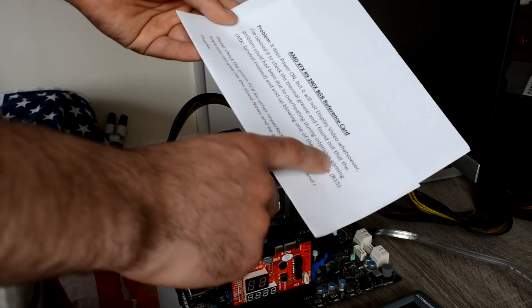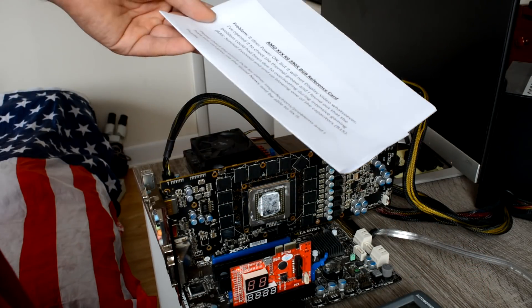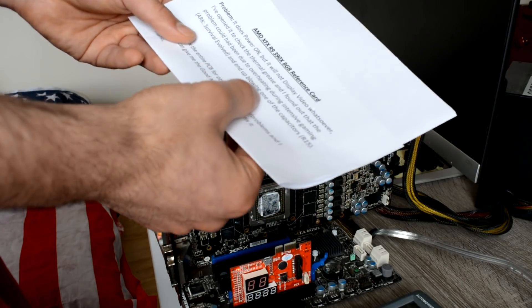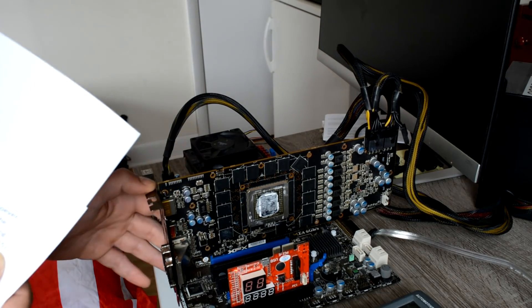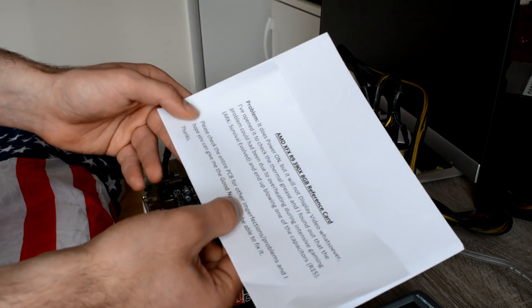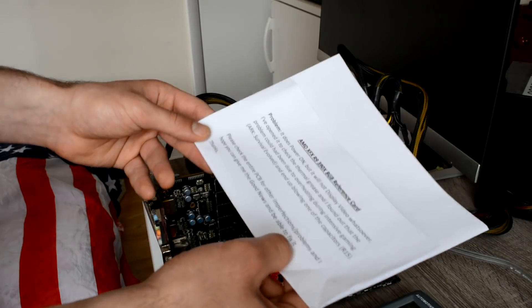Due to overheating during intensive gaming. I'd say 80% of all problems — not just on graphics cards — come up due to overheating. And it ended up blowing one of the capacitors, R15. Never seen a marking on capacitors starting with 'R', but we will have a look. Please check the entire PCB for other imperfections and I hope you can give good news and be able to fix it.